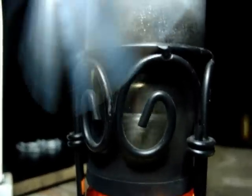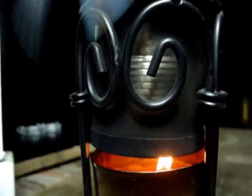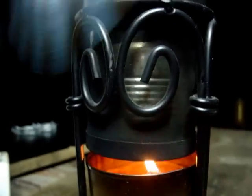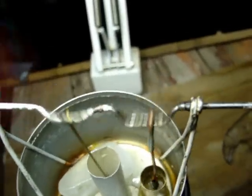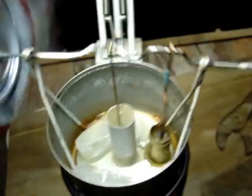When the can goes down, the air gets cold and sucks that piston down. When the can goes up, the air is all at the bottom. That can inside is called a displacer — it displaces air from the top to the bottom, and that's what makes the whole thing work. The chamber inside has the same amount of air all the time. I cleaned and scraped the place where they go. I've got a piece of pen filling on each side.